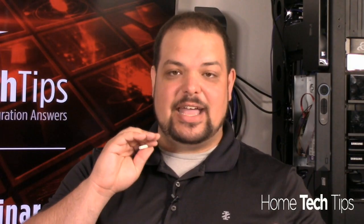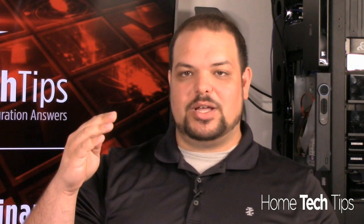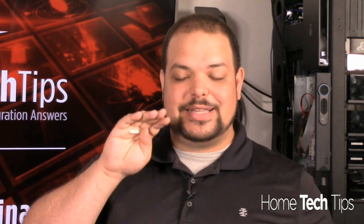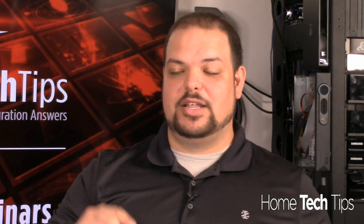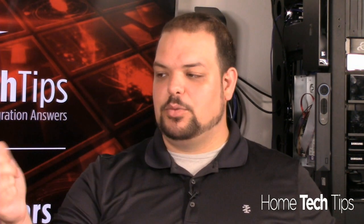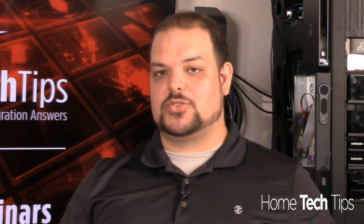When you're running that conduit, if you run it at a little bit of a slant, just like running back pipe. Ask the concrete guys how they run concrete. There's a tiny slope on it so that when the water drains, it drains off of it. Do that with your conduit. Leave a little bit of a slant in there. That way, at the low end, you put a tiny hole in there, and the water will drain out back into the soil. So really great for that.